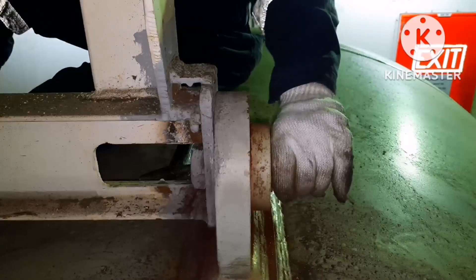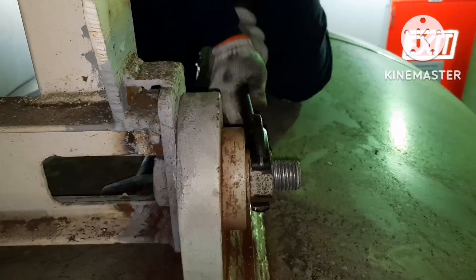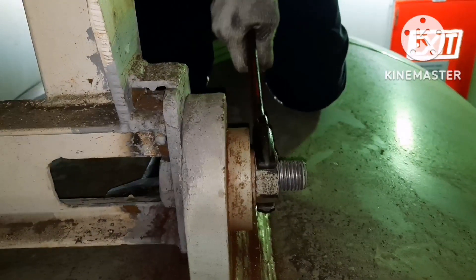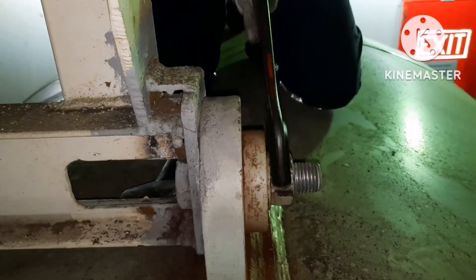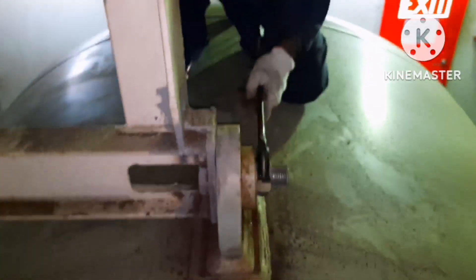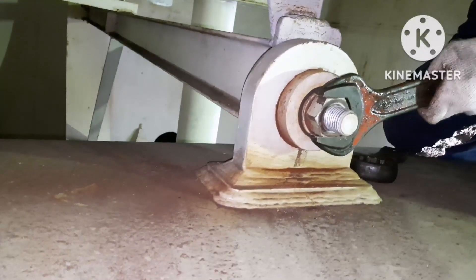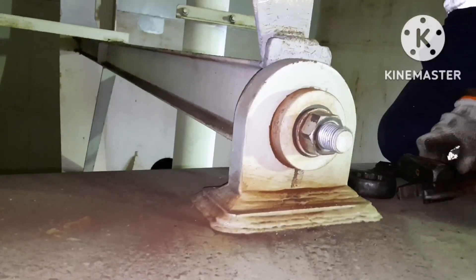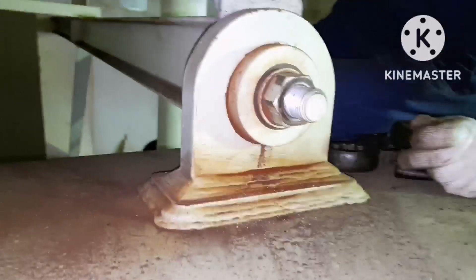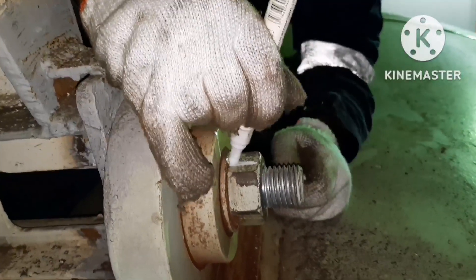Again, we have to tighten this. To tighten it, hold one side and use a hammer to tighten it. First, we have to tighten the foundation bolts of the main air reservoir. The next thing is to check the tightness of the guide support for the main air reservoir. Usually these guides will be either one or two depending on the size of your main air reservoir. After completing the tightness of both guides, you have to make a marking — this marking is to check visually from outside, so that if the marking has changed, we can easily tell that some loosening has happened.